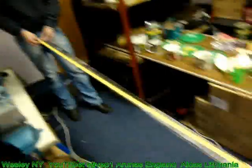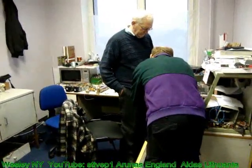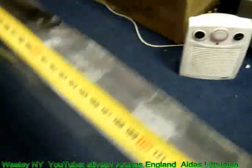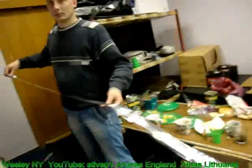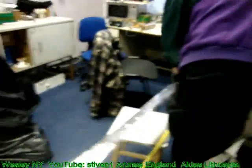They are talking here about 4 meters of length of each ribbon, and you're gonna see also on that ribbon a partially placed clear foil, which is additional insulation factor. Yeah, you see it in here right now. Okay, that's how we made a real capacitor. The first attempt that you've seen was just to find out how it is going to perform and looks like. Find out that we need more insulation for the high voltage.